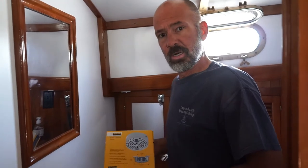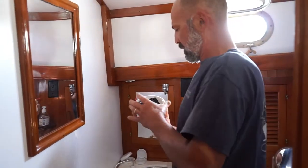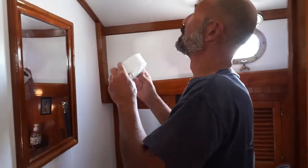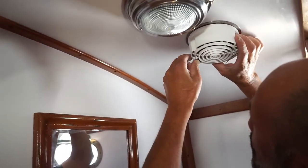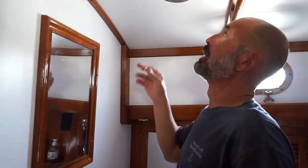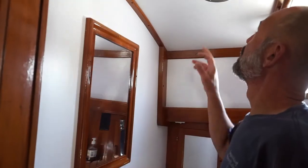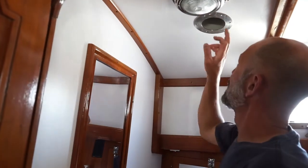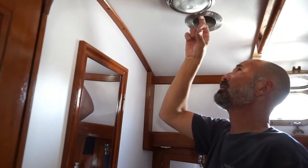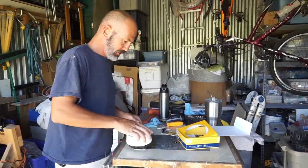This is the little Vetus electric ventilator and its specific design is to pull air out. Basically it's just a little 12-volt computer fan in a fancy white grate - not very pretty. It goes up here, you've got a speed switch, on/off, and it sucks air out and blows it out through the dorade vent. I already have the lighting wire right there - 12 volt. I do have to take it down, find different screws, then drill and tap it to fit the three-screw arrangement on the white housing.